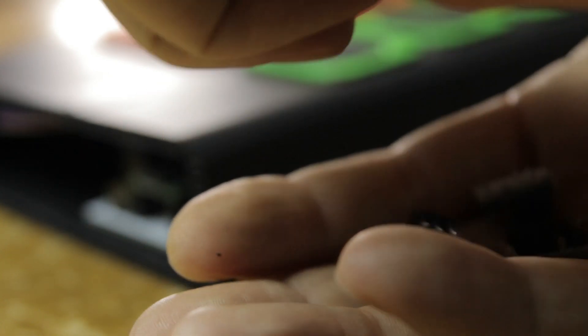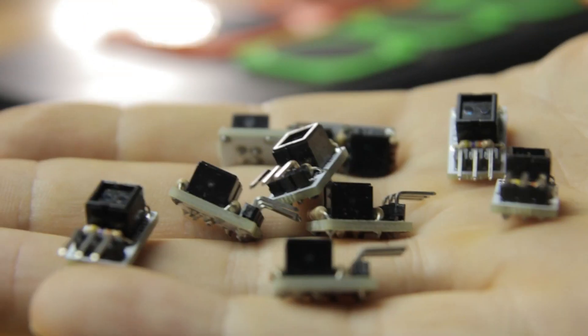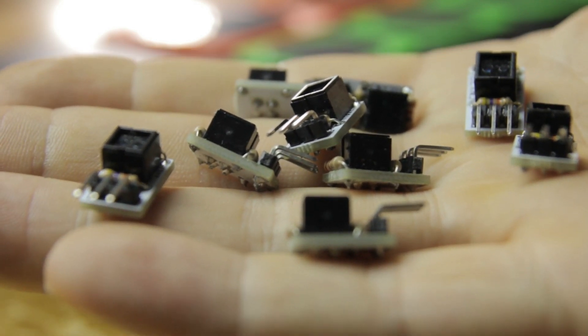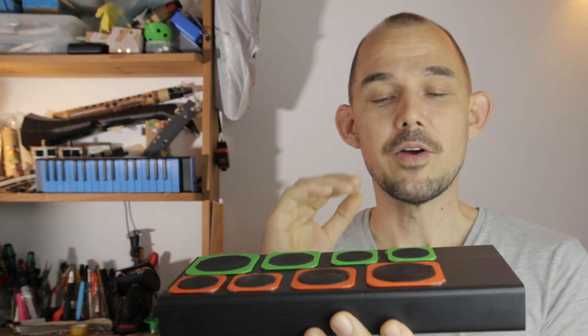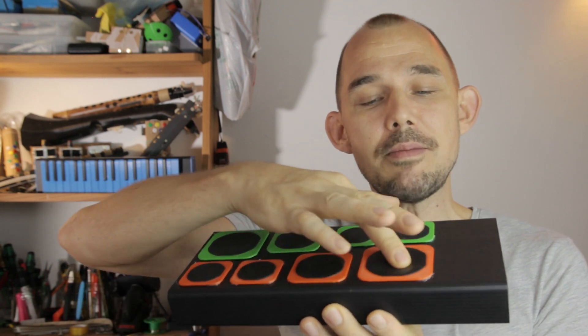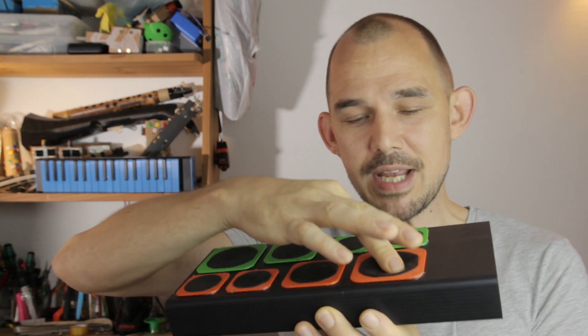All of this comes included in the Continuum Lab instrument kit — in fact, there are 10 of these modules in the kit, enough to make any three of the Click instruments. Back to the instrument: rather than measure impact directly, the CNY70 is constantly measuring the distance to the membrane many times per second, and then the Click software is interpreting that data to decide what to do.